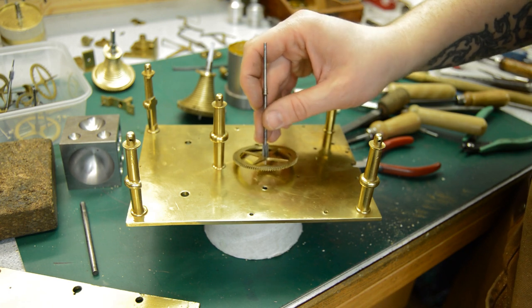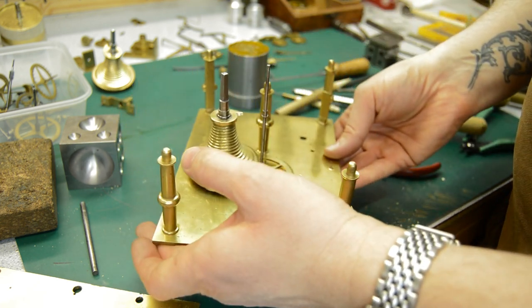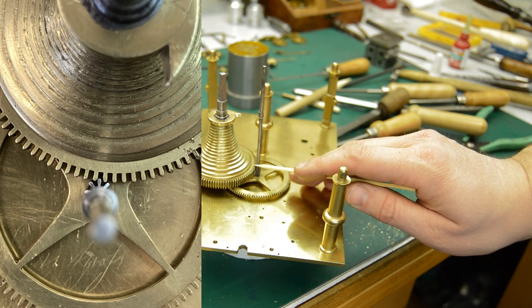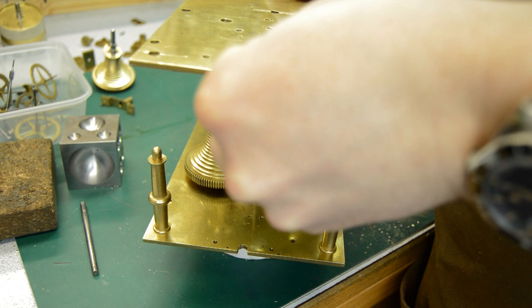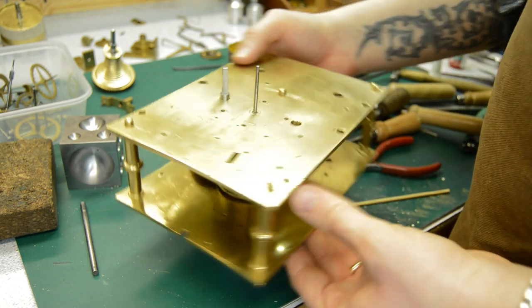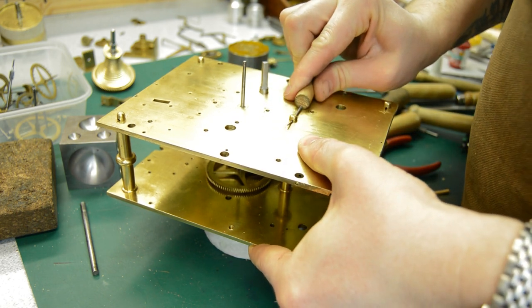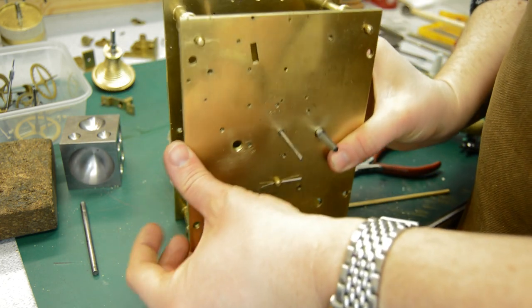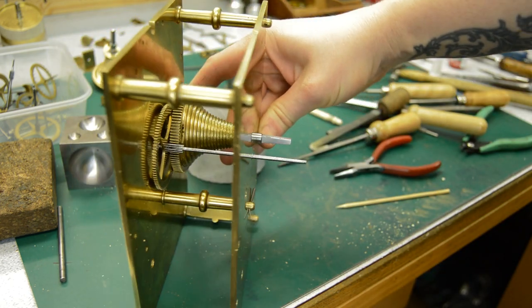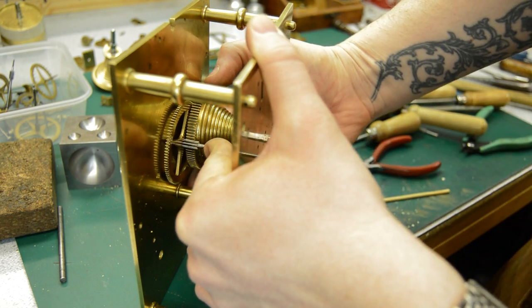There's a bit of scarring on the back plate that we'll need tidying up later. I need to check the engagement now that we've worked on the fusee — this is known as the depthing in a clock. Here you can see the depth between the great wheel and the centre, which is the area I'm working on at the moment. You can also use a depthing tool, and sometimes that is necessary. But it's important to see how they mesh actually between the plates. Just spinning it doesn't really tell you much other than that it's free — you actually need to hold the pinion that's being driven and feel each individual pinion leaf as the corresponding tooth comes through engagement.